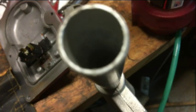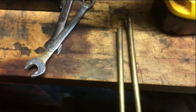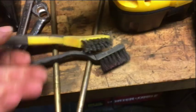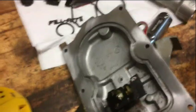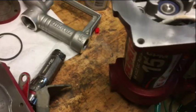That varnish - I'm gonna call it varnish, because that's probably what it is - was adhered to the inside of all of the voids in here. Hopefully you can see inside there that it is absolutely clean, and that took a lot of effort. I have various different sizes of cleaners and types of gun cleaning supplies - cleaning brushes. This happens to be a nylon bristle brush; in some cases you can use stainless steel, though I don't recommend stainless steel on surface faces for aluminum.